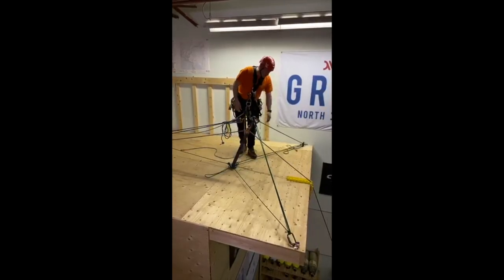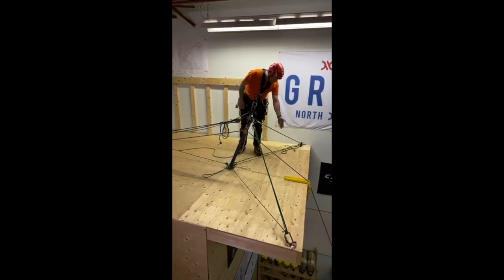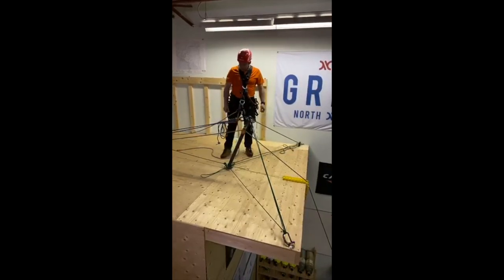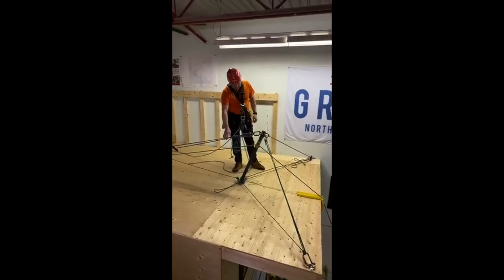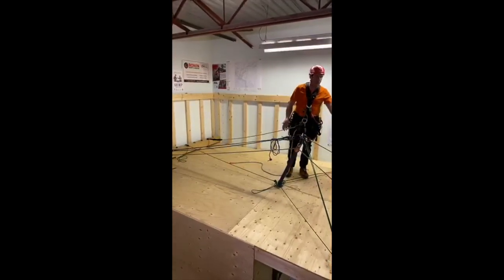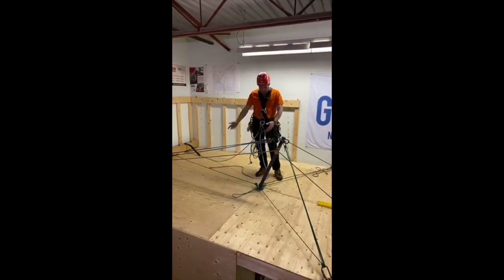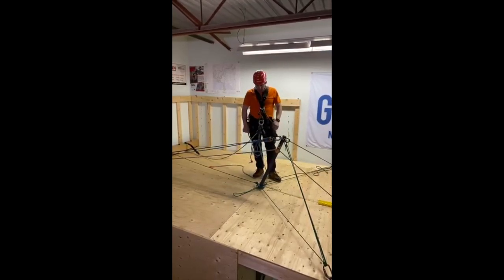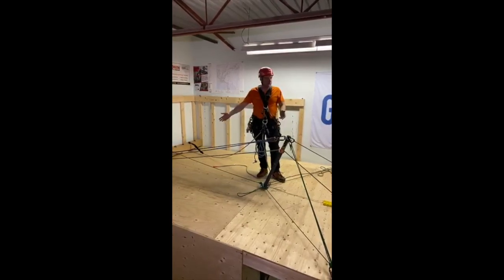I've tied this back using three different tools today. On this front tie — anything forward the change of direction we typically call a front tie — this is just a green 3-meter cord with hand tension on it. Our back tie is one of the more important ones because we always want to prepare these things back from the edge. This is set up within two meters of the edge, so it's always going to be attached to a rope before it comes here. We typically use the back tie for that purpose so we don't lose this over the cliff.